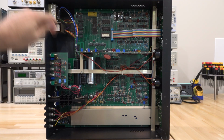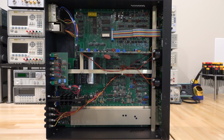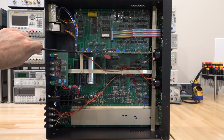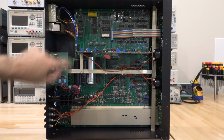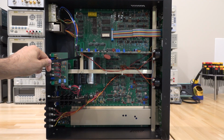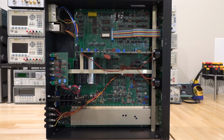And you can see that this PCB at the back is enormous, labeled SR500, so they're probably using the same PCB for the single channel and dual channel, and that can be kind of verified by this PCB here. It looks like they only changed this. And this PCB, I have to say, is sitting here in two sockets, kind of loose over there. It's only held by this little bracket over here, which is quite low, so there is nothing really holding this in place. I'm a little bit surprised at that.